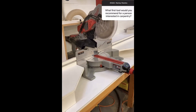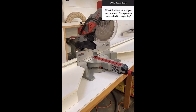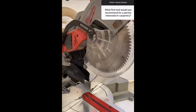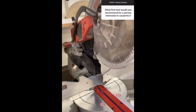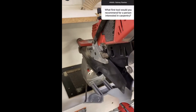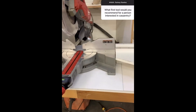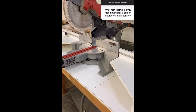The second machine I would recommend getting — and maybe even before the table saw, depending on what kind of work you're planning on doing — is a miter saw. The one I have here is a sliding compound miter saw, so it acts as both a radial arm saw because it has the sliding mechanism allowing me to cut through longer pieces of material. It can also tilt at various degrees, so you can make a mitered cut, a 45-degree angle cut. This is what you'll be using to chop pieces of wood down to a smaller size — long, skinny strips of material.